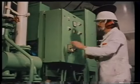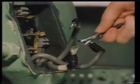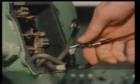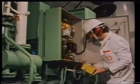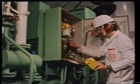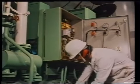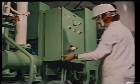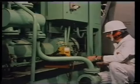You will notice that here the starter is near the motor and the ends of each feeder cable are within easy reach. If this was not the case, then first the cables would have to be tested for insulation resistance between phases to eliminate the possibility of a short circuit fault. Then one end of all 3 cables connected together would allow the testing of all 3 cables for continuity at the other ends. Having tested for continuity, the cables are checked for between-phase faults.